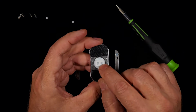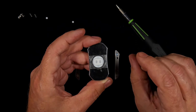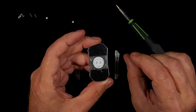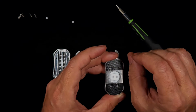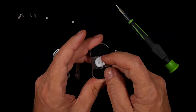The one spring in here was 0.3 wire diameter. Okay, that means it's fairly springy. All the other springs are 0.25 wire diameter, which make them a lot softer. And they only give you one of the strong ones and then a handful of the softer ones. So, not good. Like I said again, you should get all the parts that you need.